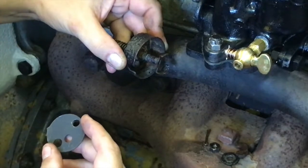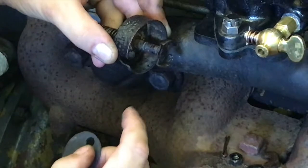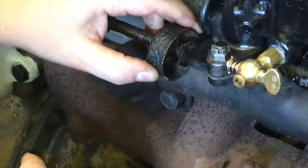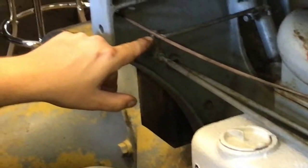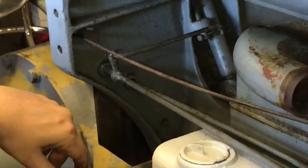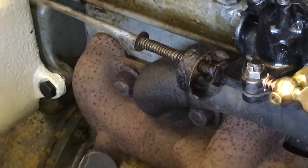We've lightly cleaned the inside of this cap out. You can see the friction disc needs to sit to the bottom of this cap. The problems that present themselves are that the control piece for the carburetor is peened onto the end of the throttle control shaft, and on this model someone has welded part of the linkage to the throttle control shaft. Our only options are to try and cut this off and salvage what's here, or make a modification to this disc and cut it to fit it around the throttle control rod.